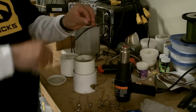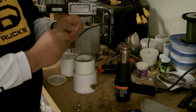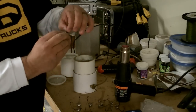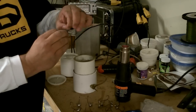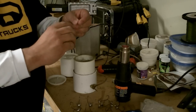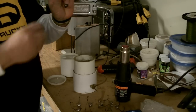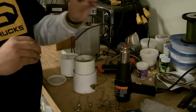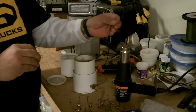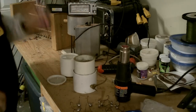After we think we've got it sufficiently heated, we dip it through. See how it's nice and shiny? That's what you want. Powder paint when it adheres to a very hot lead jig will get a real glossy finish — that means it went on well. It may even smoke a little bit, which just means the jig was a little bit too hot. Now I take a piece of copper wire — a gauge that matches the exact width of the eyelet — and push it through. It grabs a clump of powder paint while it's still hot and pushes it out of the eyelet. It hardens on the end of the wire; you just peel it off. Then I put the jig back in the heat source to clear off any little strings from pushing that out, so you get a nice shiny finish and a clear eye.